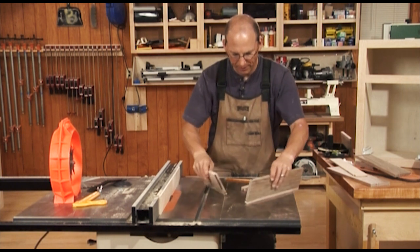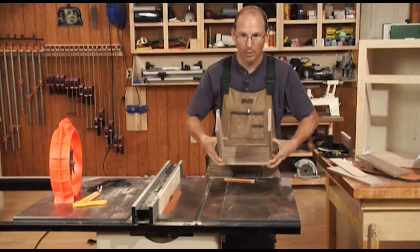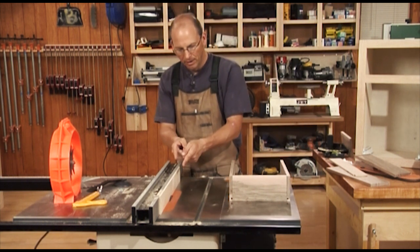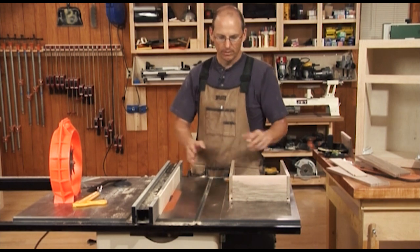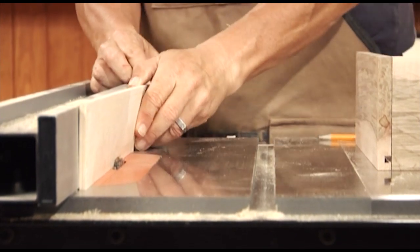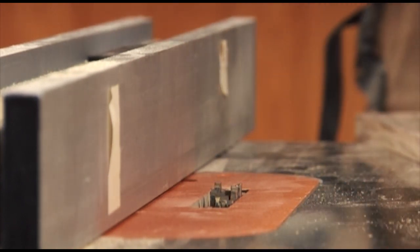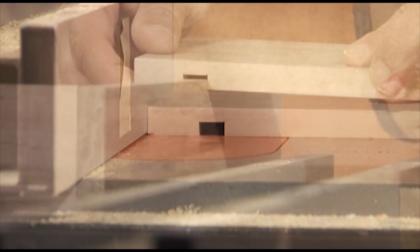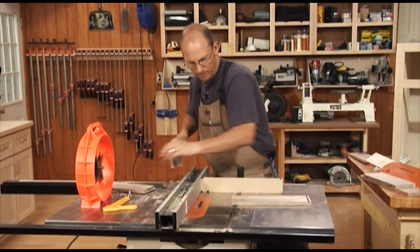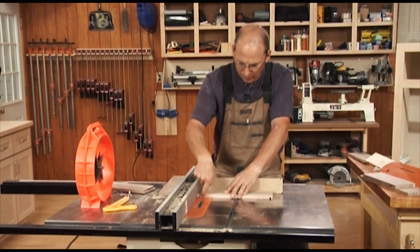With our grooves cut in the front and the sides, we now have a place for the bottom. One more thing we have to do before we put the bottom in is cut the dado for the back. If you've got multiple drawers to cut, go ahead and make them all now. We'll switch to a half inch dado blade — a dado blade that's the thickness of the drawer material. I'm going to set the dado blade so that it's about one inch from the fence and make a test cut. Now we'll take our sides and on the inside face of the drawer side, we'll cut the dado at the back. Here's where our front will attach, and now we're making our cut for the back.